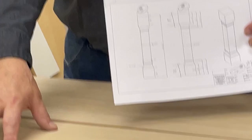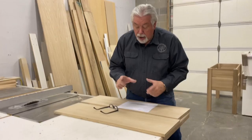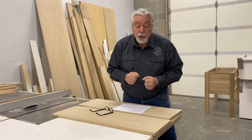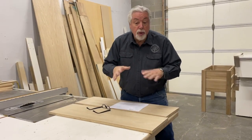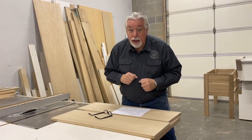This is the plywood we're using right here — just veneer plywood. We're going to cut our pieces four and a half inches wide with a 45-degree angle on both sides and glue them together with just glue and tape. Let's go ahead and get that far.